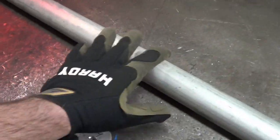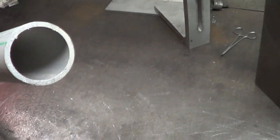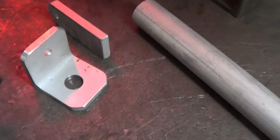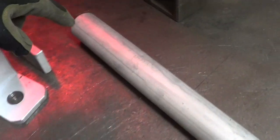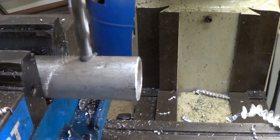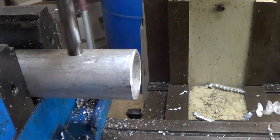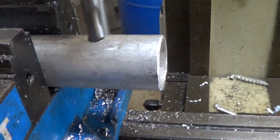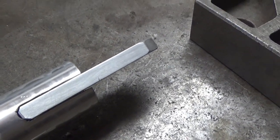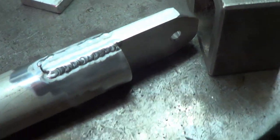Here's our support for the Coraloma exhaust. We've cut out some flat stock, some tabs, a piece of aluminum tubing, and some L brackets. We're going to slot this and weld these to create our support for the exhaust. We drilled holes two inches up and then cut with the bandsaw up to the hole to make a slot. We've got the tubing notched — drilled it with a drill press and cut it with the bandsaw. And now we're TIG welding them into place.